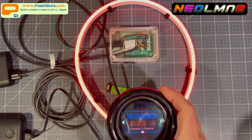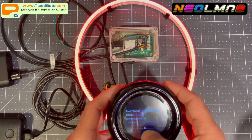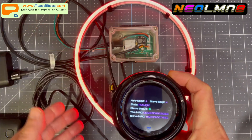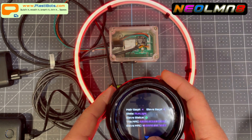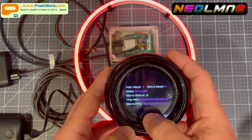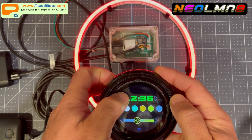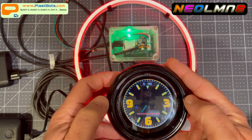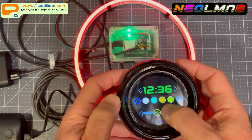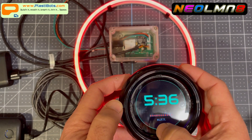Here's a quick change — I actually just wanted to play that sequence. I can also save it to EEPROM so that later on when the car starts it'll use that sequence in the future. This screen here is just a status screen so I can check on what's working. The red indicator on this screen is an actual status indicator as well. I've also got options where I can change brightness settings, as well as the actual clock face — I can go from an analog clock face to any of the digital clock faces, save that change, and also change colors — the theme color of the watch face.